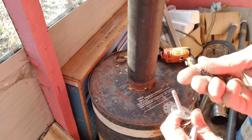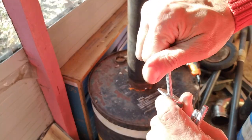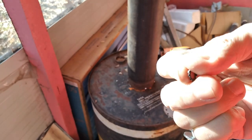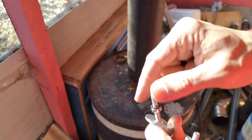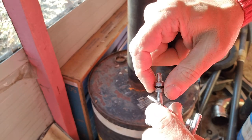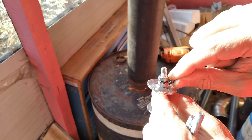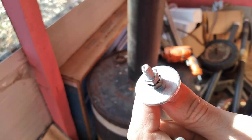On the other side there's going to be another washer. That's what it's going to look like, and where my finger is, that's where the drum is going to be. Then I'm going to have two of these things: a nut to hold it in place, and then one of these little crimping washers, which prevents the next nut from coming off with vibration because it crimps it there. So I'm going to have two nuts on the outside squishing this down, and possibly another crimping washer between the washer and the nut.